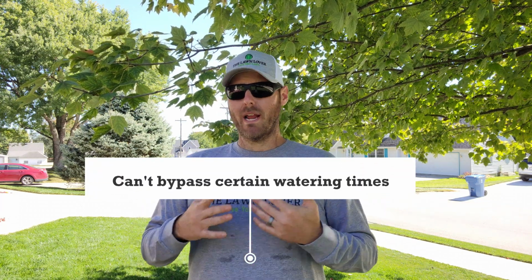So for example, when I overseed, I plant my seed and want to water it 3 times a day. Say I usually do 8 a.m., noon, and 4 p.m., for 10-15 minutes a zone each time. So when I want to do that, I basically set my programming to run at 8 a.m. and then set it for every 4 hours so it runs at noon and 4.